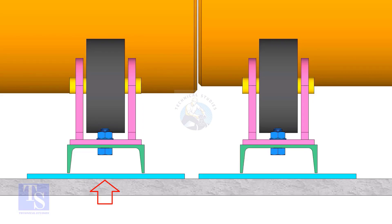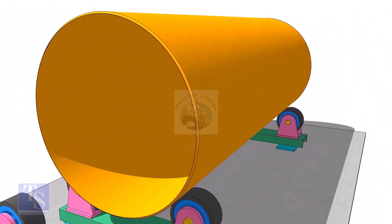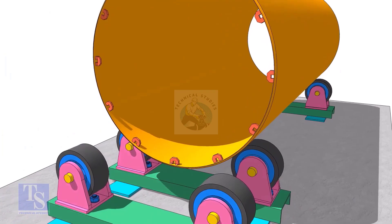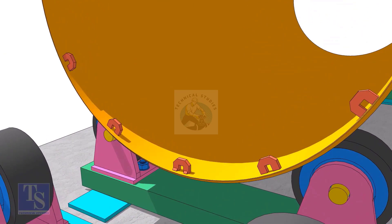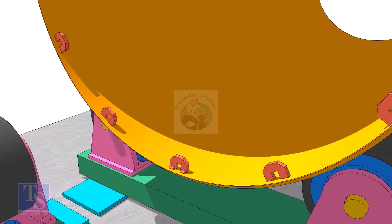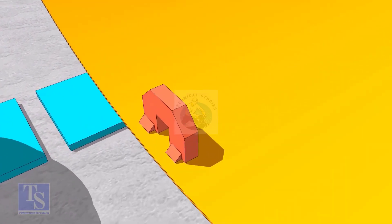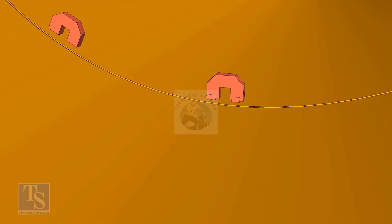If you want to make sure that you can fit in the middle of the pipe, tack weld the C's on one shell near the end, as shown. If the thickness of the pipe is less, you may need more C's. Don't weld two big tacks. Always tack weld from the wedge side only.